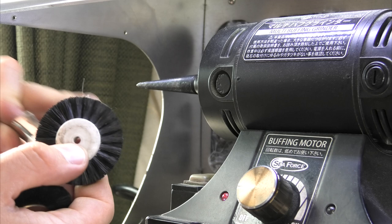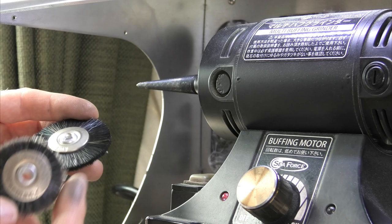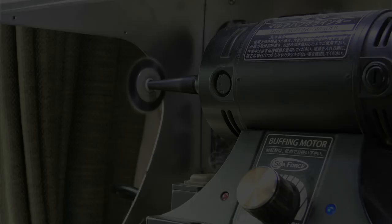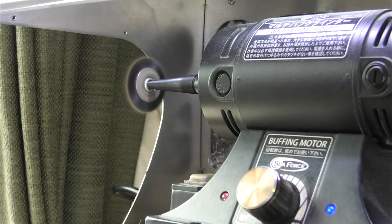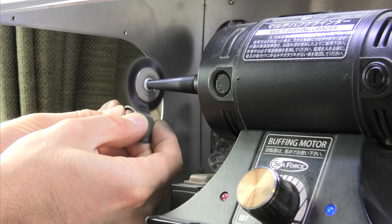The best tools for this are these bristle brushes — you want quite a stiff one. These German ones are the best; it just says Germany on one of them. There's an old Bellotti, West Germany one here — these seem to be particularly good. The more worn out they get, the stiffer they are, so really worn-out ones are actually great tools. Load the brush up with polish and then you've got to keep the piece moving because the stiff bristles can cut into the metal quite severely.